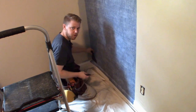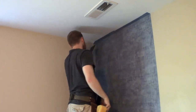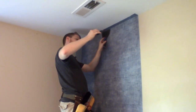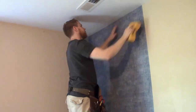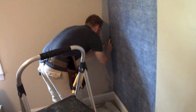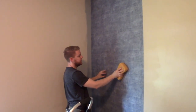As you're brushing it might pull your seam apart, but it's easy enough to slide it back together. This is where your putty knife and razor knife come in — you're going to pack the paper down along the baseboard with your putty knife. When cutting along your ceiling line, flatten your blade out up against the wall more so than angling it; that reduces the risk of cutting through the tape between the wall and the ceiling from when the house was built. Make sure you get all the paste off the finish of the wallpaper — over time paste can attack the finish and make it flake off.